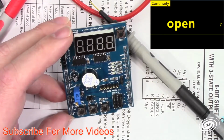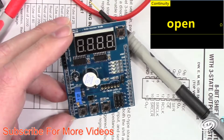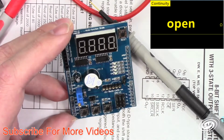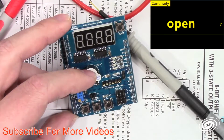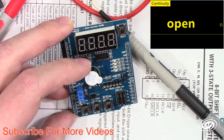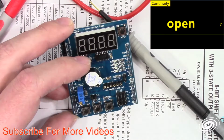Okay, so then we have digital pin 0, 1, 2, 3, 4, 5, 6, 7, 8, 9, 10, 11, 12, 13. So pin 0 and pin 1 were on the Bluetooth. Just write Bluetooth. And pin 2 was this U4 IR-2 thing. Pin 3, we didn't see anything on pin 3. Pin 4, nothing for pin 4. Pin 5 was the breakout. Pin 6 was breakout.